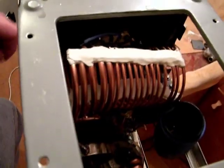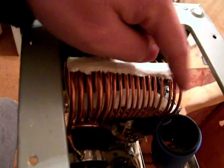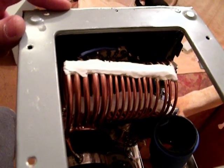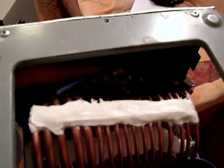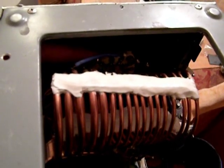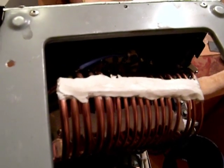The coil of the Pi filter: the first five turns are done using the same copper pipe from the Dacia brake system, and the other turns are made in solid copper wire, about 6 mm square — that's the cross-section, not the diameter. There you can see the Pi filter band switch. It has to be a ceramic one — you cannot use Textolite, Pertinax, or anything else because it burns in flames. I recommend the Russian rotary switches.